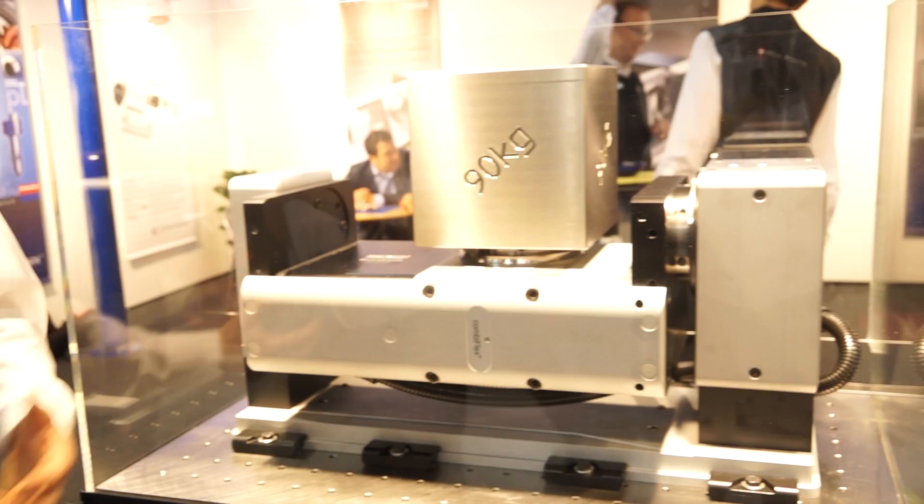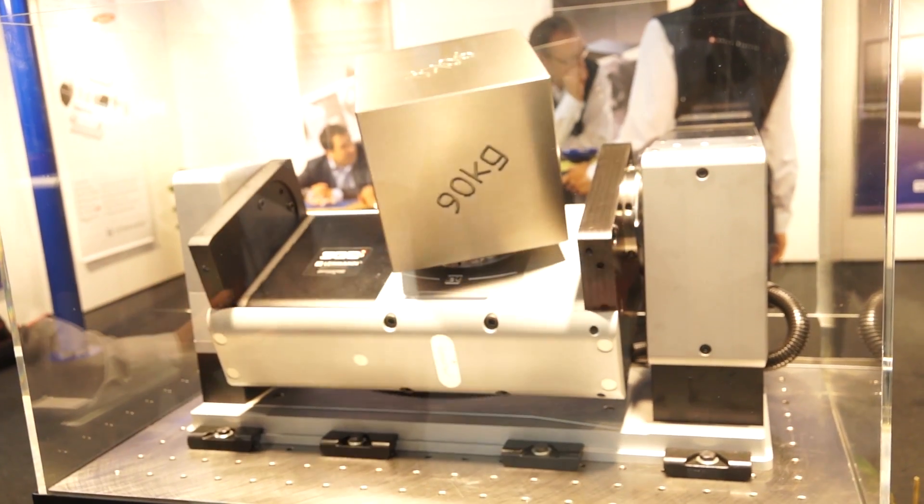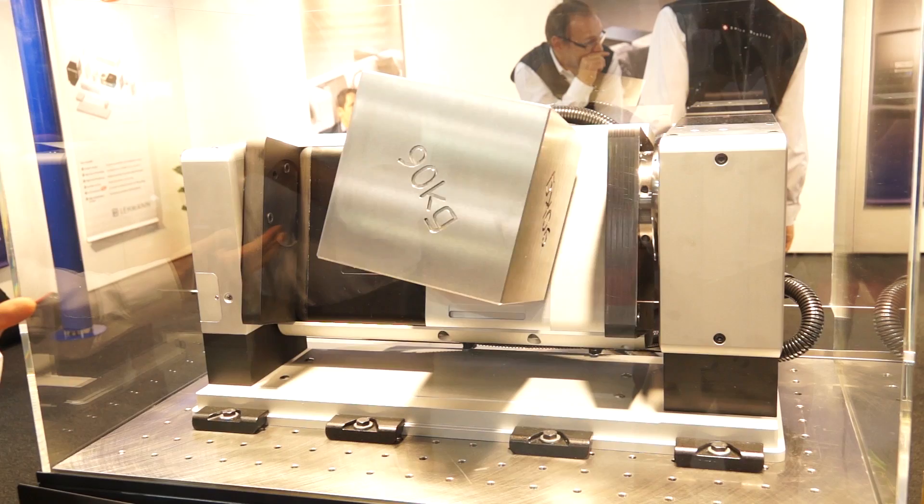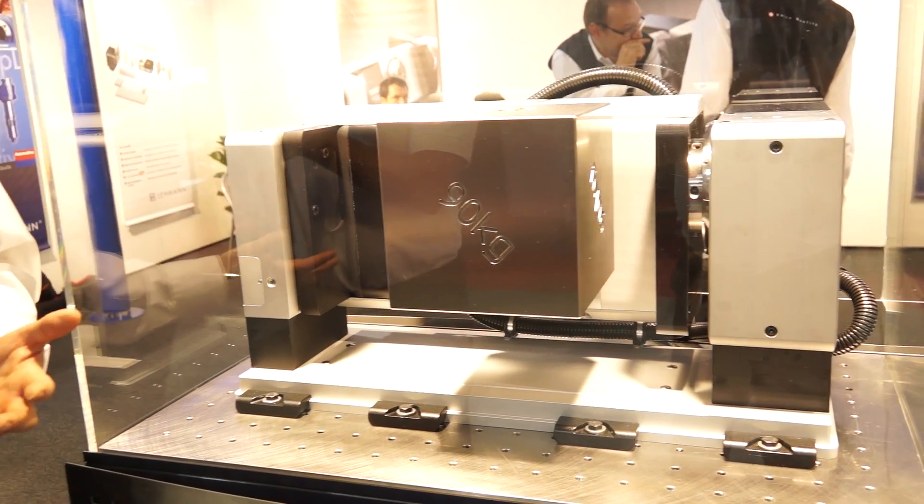The argument there is versatility over an integrated five-axis machine — here you could be looking at having the best of both worlds. That's right. If you've got a five-axis machine, you are usually restricted to a fairly small work area, whereas with this you've obviously got the benefit of the same specification as a five-axis machine. This is capable of full contouring capability, doing the same work. With Lehmann, you have a preloaded gear drive which gives you the same characteristics as a direct drive, so you could do impeller work on this type of table.